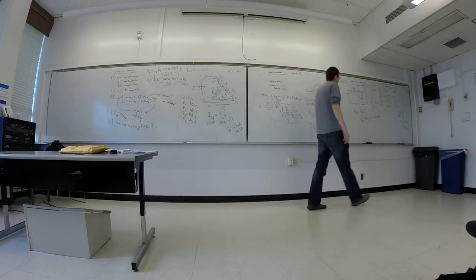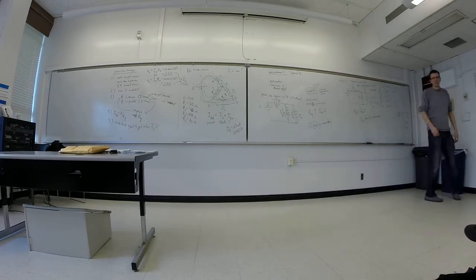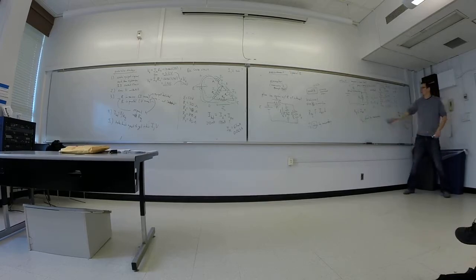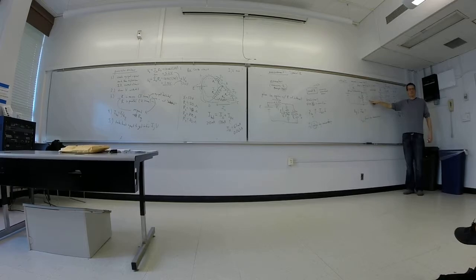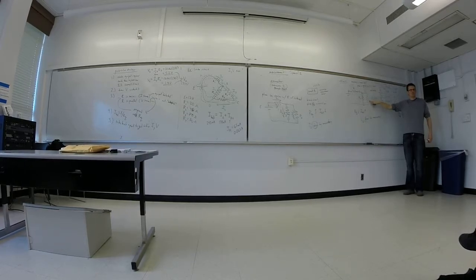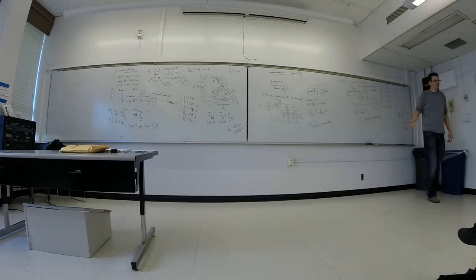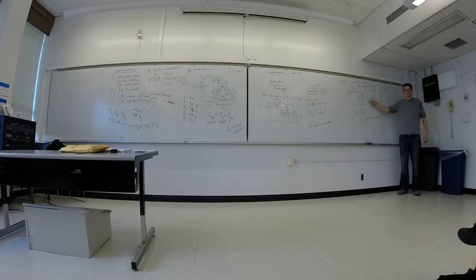So again, let's think about this. What could we do to minimize this measurement error? Now, would we want the voltmeter to have low resistance? No. If this was a straight wire, this voltage drop would drop to 0. So what's good is that? We measure 0. It wasn't 0 before we got there, but now it's 0. We in fact want this extra parallel branch to be such a crappy option that no one would really want to take it.